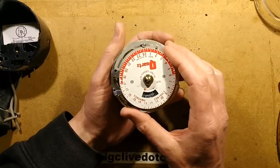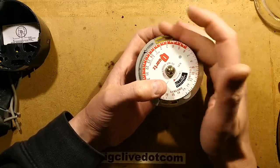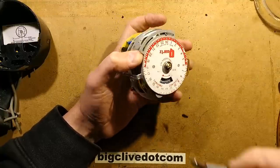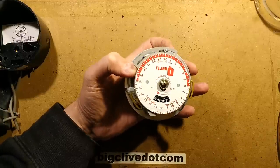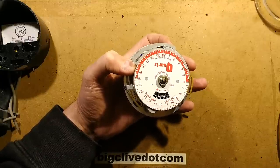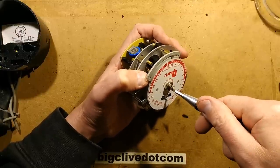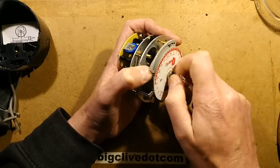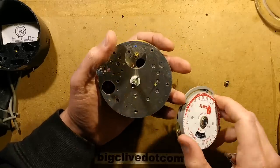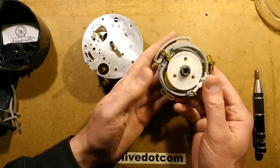This is a solar dial. You can set the time — it's got two floating brass sections here. You can change the dial entirely; you can put on an ordinary dial with fixed positions around the edge, either drop-in pins or pins that ride in a guide. You just loosen it off, slide it to where you want it, and lock it. In this case it's been locked to go off every night at 2400 hours — midnight — which is really typical for the Isle of Man.